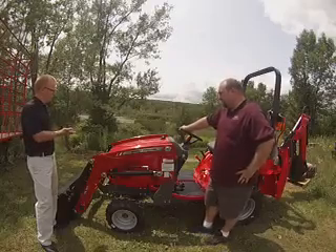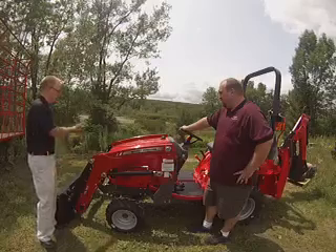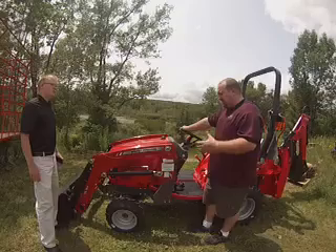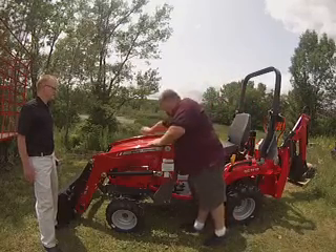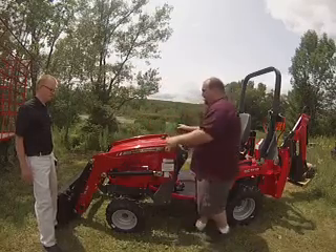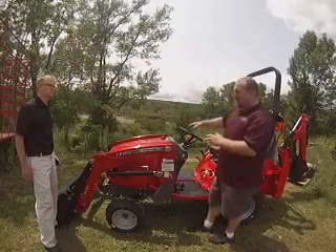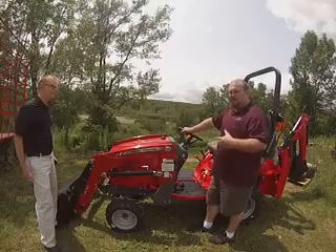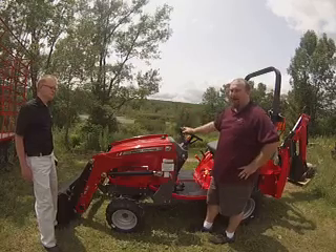We had talked earlier — tell me about the hoses. I can't even see the actual hydraulic hoses on the other side over there. Again, a part that really makes this loader stand apart from a lot of the competition is the fact that the loader hoses are now recessed into the frame of the tractor on the right-hand side of the machine. What that does is give you a better view from inside, sitting in the operator seat. You're also able to reduce the risk of catching a hose on a limb, driving through the woods, or even catching a rock on it during material handling.